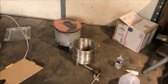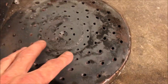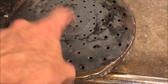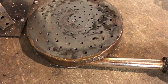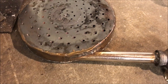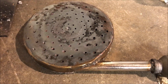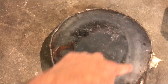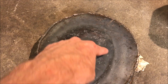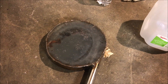That thick piece of stainless steel I showed you is going to be used to fabricate the burner plate. We cannot have this made out of regular steel — that's just not an option, it will burn up pretty quick. We'll probably try to use this same setup and just cut the plate off and install the new stainless plate. On the bottom of this burner we are going to be installing a spiral pancake coil connected to the bottom — that's going to serve as our primary preheat.